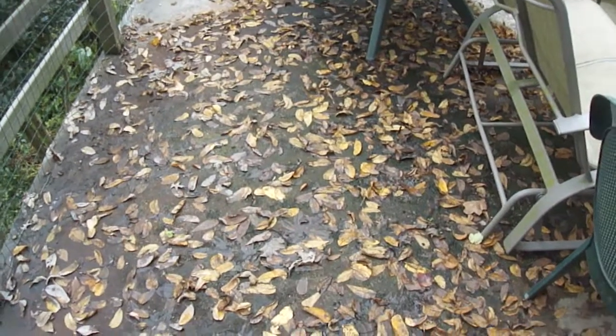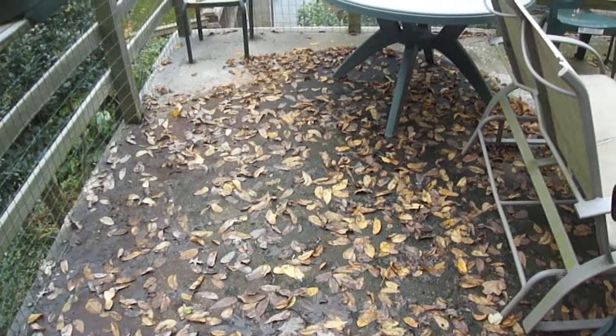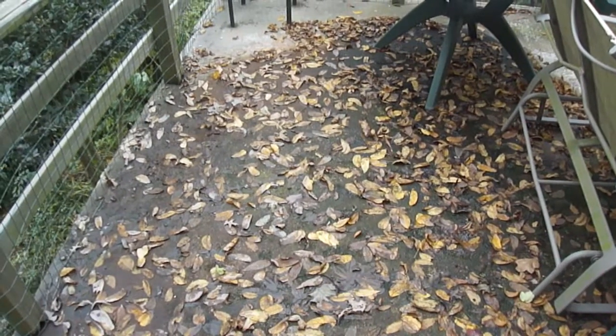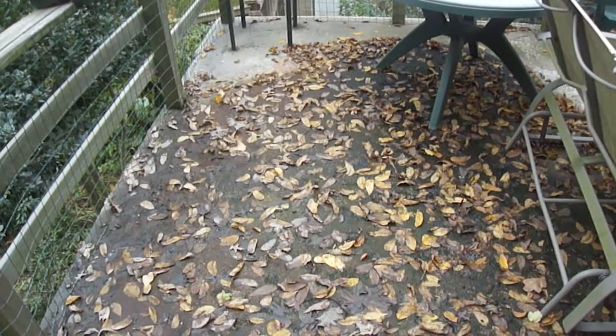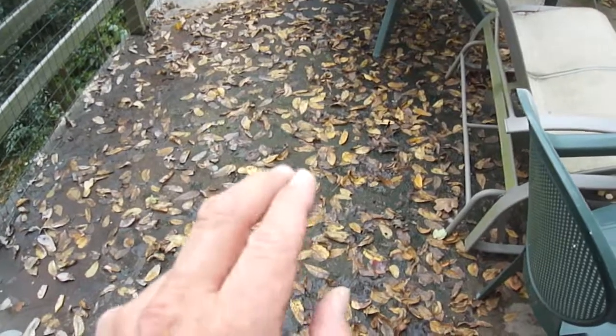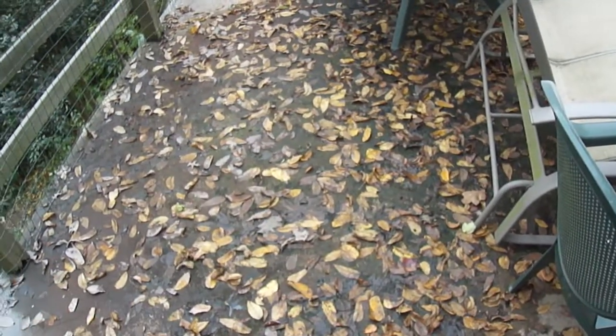The right way to do the back porch would be to put some type of hard surface on it — flagstones, or walkway blocks, or tiles — to keep the cement centered right here. The cement would pitch off the water, mostly in this direction, off the edge of the porch. And we had steel lathing and stucco along here, like we did on the front of the porch.